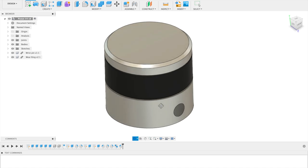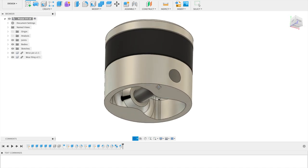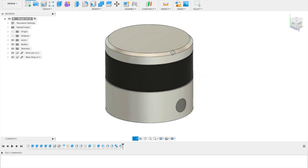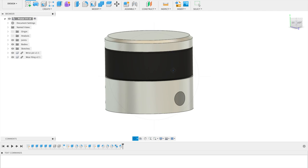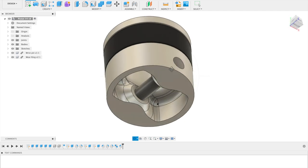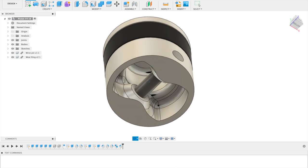I'm going to start with the piston. This piston is very similar to the piston I manufactured in my last video — it's almost exactly the same except for a thicker piston head. It has the same wear ring which will help reduce friction and improve seal, and it also has the same stainless steel wrist pin which will also help reduce friction.